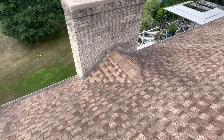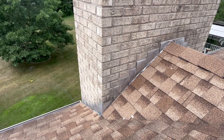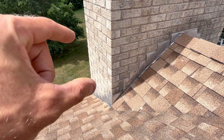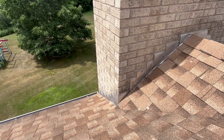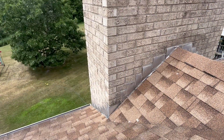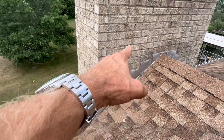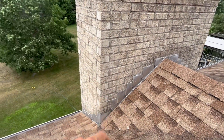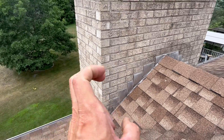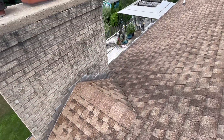You've got a chimney flashing, so you have to look at all the step flashings exposed. It's tuck pointed right into the grout. What we'll do is we'll likely replace that — we'll put new step flashing and it won't be tuck pointed into the grout. We'll grind a line into the chimney and cover it with a riglet cover. It's basically a counter flashing to cover that step flashing. The riglet has a little lip that's usually five or six inches tall to cover that step flashing. We pop maybe a half inch deep, tap the lip of that riglet in, and then caulk it. That'll cover all this step flashing. There are pictures of the riglet in the field model if you don't know what it is.